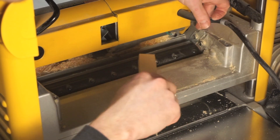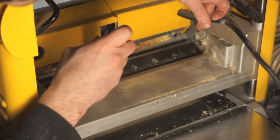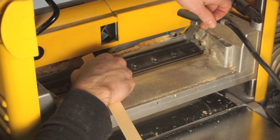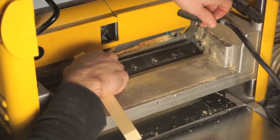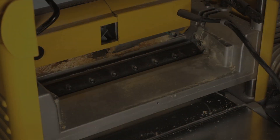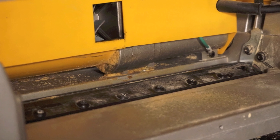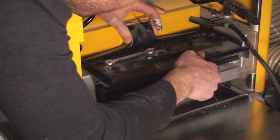Let me recap those steps. First, remove the eight bolts from the knife clamp. Then use the magnets on the T-Wrench to attract and remove the knife clamp, then remove the knife from the machine. If only one edge of the knife is worn, turn the knife around so the sharp unused edge hangs over the edge of the cutter head where it will cut the material. Two: reset the knife clamp by aligning the beveled edge of the knife clamp with the cutting edge of the knife. Three: place the screws through the holes in the knife clamp and the knife into the cutter head. Four: tighten the screws sufficiently.